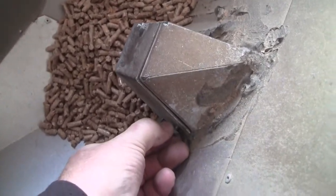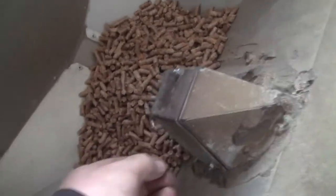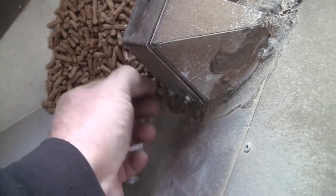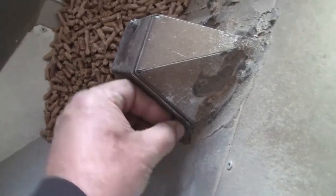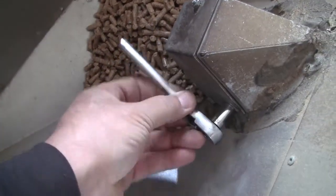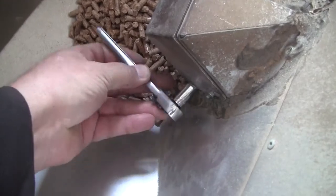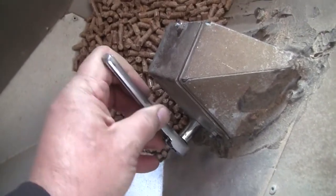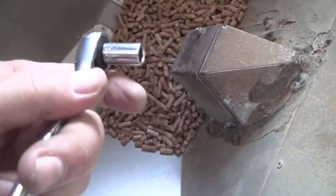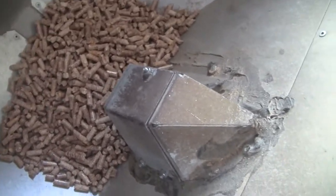This stuff will probably never come loose. Put the star washers on there. This is a maintenance item on this era of pellet stove — the Profile 30. Having that electric eye in there, the lens gets dirty, and it can stop the machine from running. It'll start up but it'll shut off after half an hour, 20 minutes. See how easy that is? Maybe it's five-sixteenths, or 11/32nds, maybe it's metric — I don't know. And that's what you need to do to clean that.